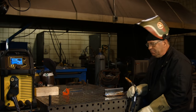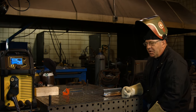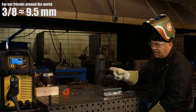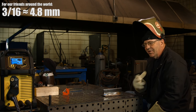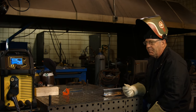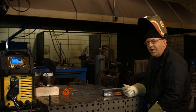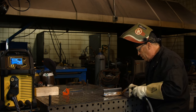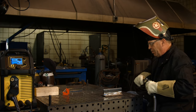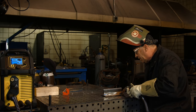Welcome back. I tacked these up on the backside. I'm running on the S-MIG side of this — 250 inches a minute, 3/8 plate, though it only goes to 3/16ths on the program. Experimenting here to see what's going to happen with the arc feature and the bead size, but I'm running on 95/5 gas. I'll probably be straight in, maybe slightly pushed — let's get going here.